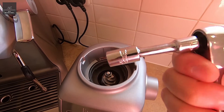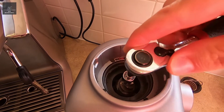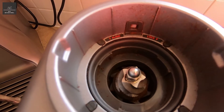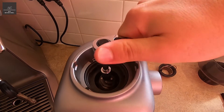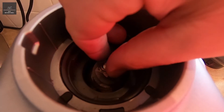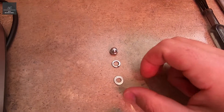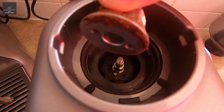So let's open it up. We're going to need a 10mm socket and ratchet like this. You could probably use a ring spanner but it might be a little bit harder. Now we're going to loosen this nut off, and we have to be careful of these washers and their positioning — we have to put them back the same way we took them off. To remove this particular nut, it's actually a clockwise direction, so it's the opposite of what we'd usually do. So I'll take that nut off, and then we've got a spring washer, and then a flat washer. So: nut, spring washer, flat washer, and then the gear.